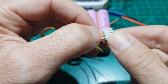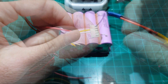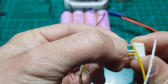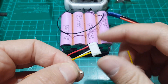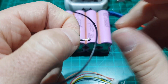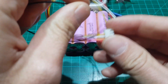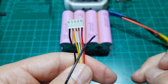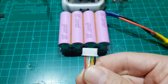Now moving on to the last but maybe most important step: the balance port connector. I am rearranging the pins — I want you to do the same because the colors I am referring to may not be the same in your connector. Starting from right to left, we have the red cable, the orange cable, the white cable, the yellow cable, and last the black cable. Check it out and copy it before proceeding.